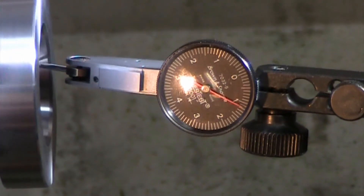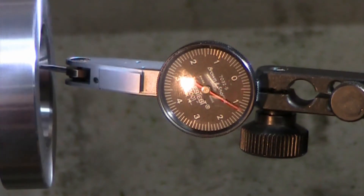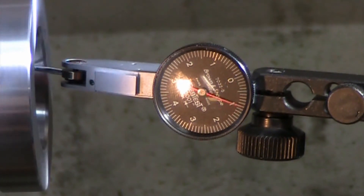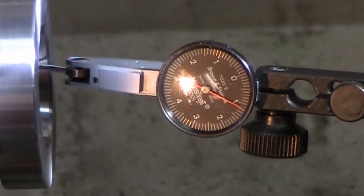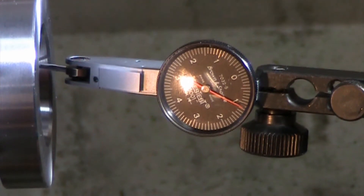That's interesting — the way it's jumping around like that, it's obviously not round. It looks like maybe at some point they stopped the grinding wheel and let it dwell for a second; it's kind of jumping around a little funky. Certainly not good. Alright, let's get to setting up the taper on the compound slide and we'll walk through that.